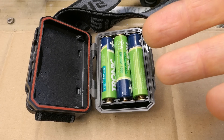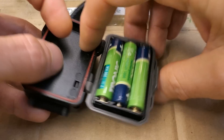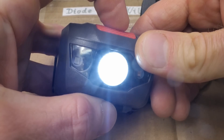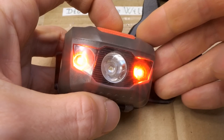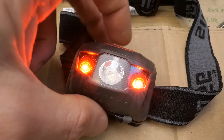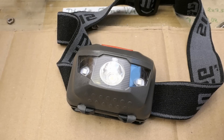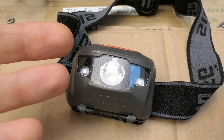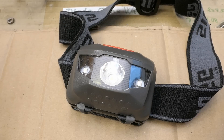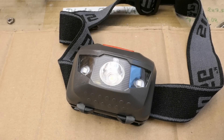We'll take a quick look inside and do a modification. The plan is to replace the red LEDs with yellow or white ones. It's actually useful to have a red mode, but this one has the red mode so dim that it's absolutely useless — low power and not well-focused either. I'll try to put phosphor yellow or warm white LEDs in to get a different color and also a wider beam option, since this one is quite narrow. Having a choice of wider and narrower beam is more useful than having the red mode.